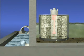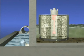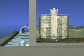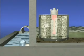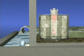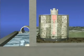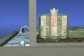The siphon effect increases the effectiveness and useful life of the filter cartridge, and continues until the stormwater in the vault begins to subside. A hanging water column remains under the filter cartridge hood until the water level in the vault reaches a series of scrubbing regulators on the bottom of the hood.